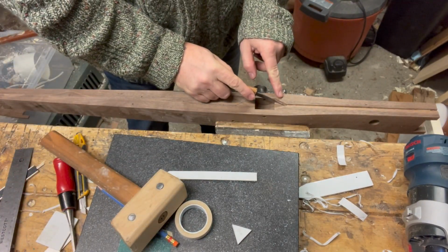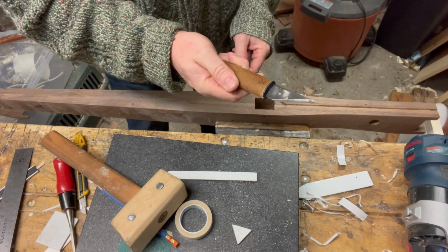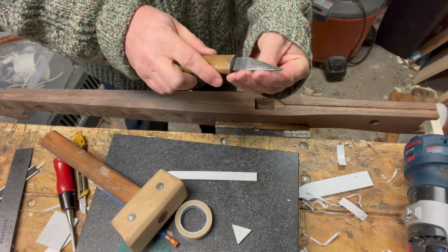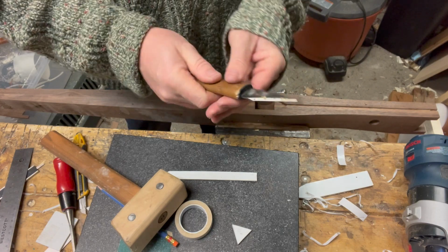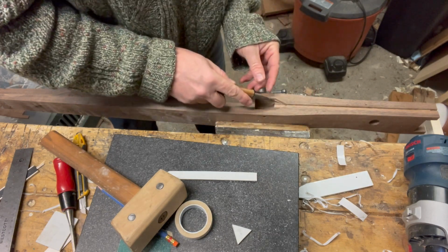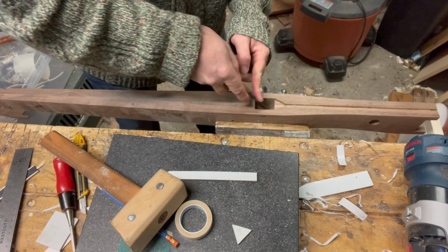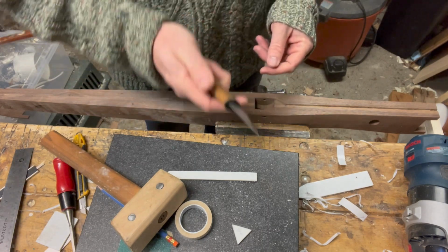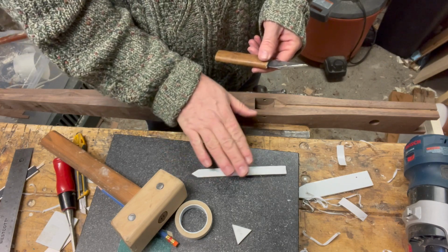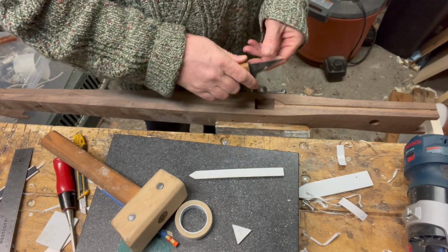When you're getting into these small little spaces, like really small little points like at the point of this triangle, it helps to use a little knife. This is a little Japanese knife. I love this thing. It's really cheap. It's called a kiridashi, and it's got a really nice one-sided bevel, so that's called a chisel grind. So it's super easy to sharpen. It's carbon steel, so you can get a really sharp edge on it, and it's got this little point that you can get in there to fish out the rest of that waste material. And when we get around to starting to really finish off the surfaces, a knife like this is great. You can make it really sharp and use it for scraping. And you'll see later on that especially when we're finishing the surfaces where the plastic is, the plastic responds really well to a scraping motion.